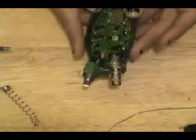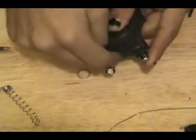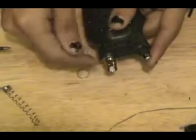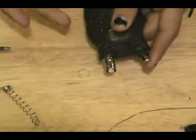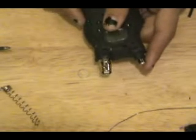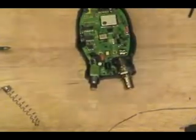I'm going to go ahead and put this thing back together screw by screw. One thing that really should be done is putting another ring of hot glue or even epoxy putty around the edge of this so it adds some strain relief. Because if you're going to be putting antennas on here, you're going to have coax or larger antennas that could put a bit of stress on this, and you don't want the hot glue to eventually weaken and break off.